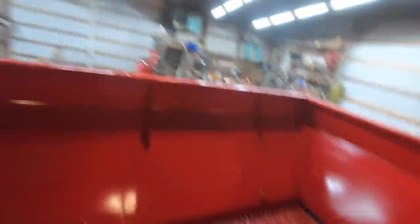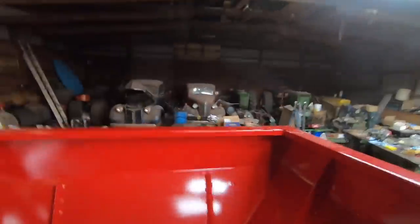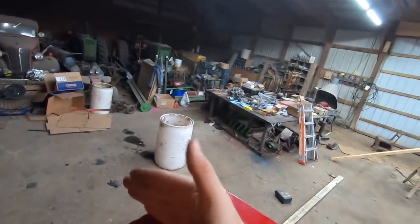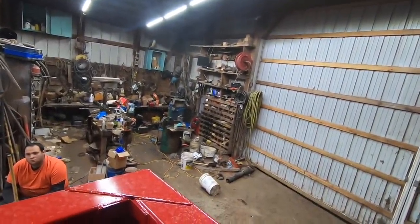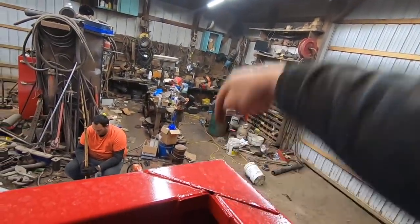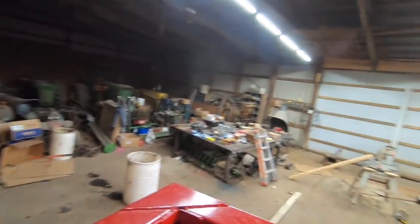I've lost a lot of weight, gained some muscle. So up top here it's four and a half inches wide, and we'll run it the full length of the spreader. This is a 16-foot spreader — a 16-foot litter slash lime spreader. I'll lay the second piece across and butt them in. Then I'll just bolt it — drill holes through, probably four bolts there and probably eight bolts on either side. The next board will overlap the outer one and we'll lag them into the outer ones. I'll be countersinking them so they're not sticking up.